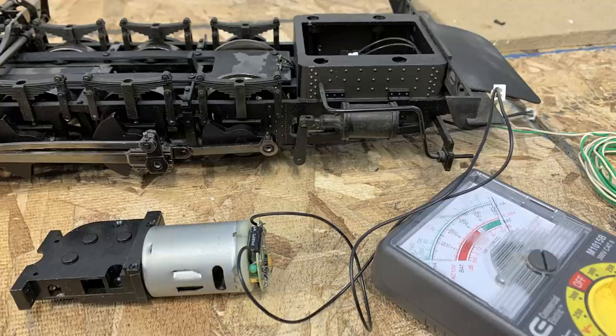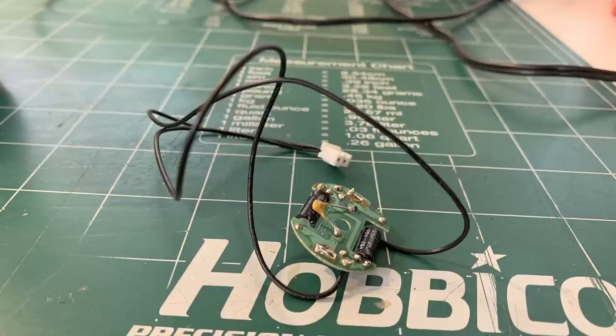I don't know what that board does — it's just up there. Why aren't they just feeding the power directly to the motor? I just pulled the board off, and there's the short right there. I don't know what this board does, but it allows DC to run directly to the motor — DC passes through it directly to the motor and it runs normally. But DCC, or my meter, or anything else sees this thing as a short.